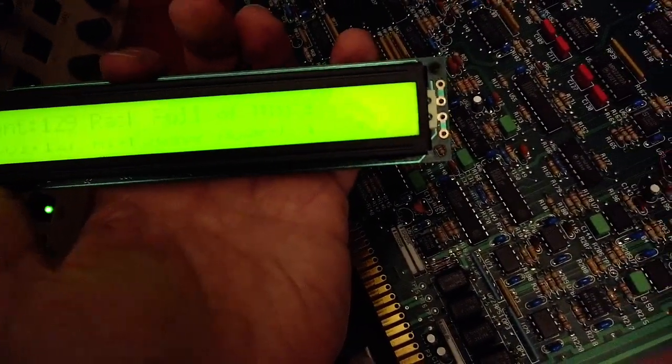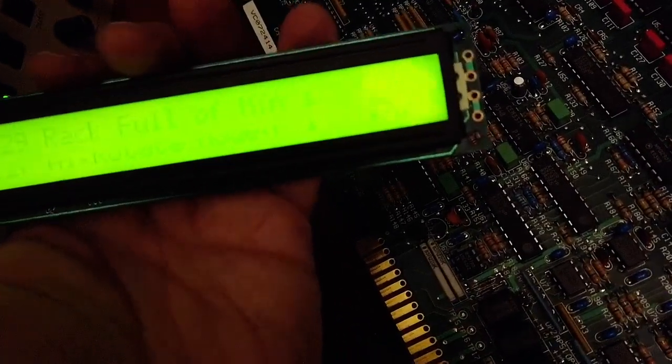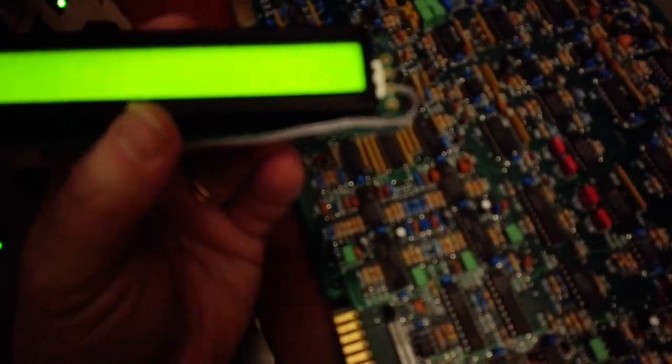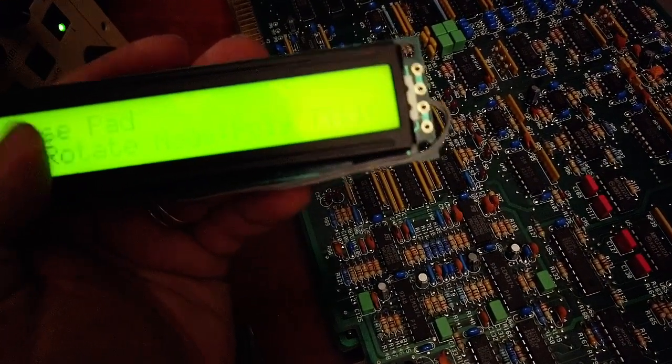This is the best I've got. The top line is actually readable, except I have a missing character. The second line of text has the top row of the characters kind of chopped off. After more fiddling, it looks like all the characters are readable now. I have to look at it at the right angle and they are a bit faint, and I can't improve them by pressing on it. But now whole sections are very nice and readable. It looks like I have all the connections lined up - no missing rows or columns. It really just wants more pressure.